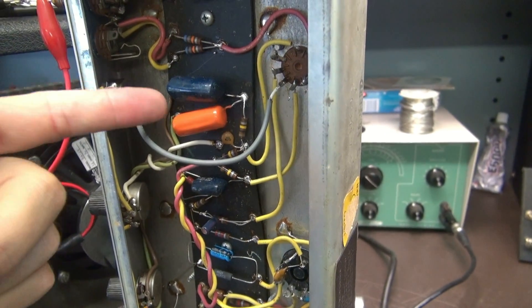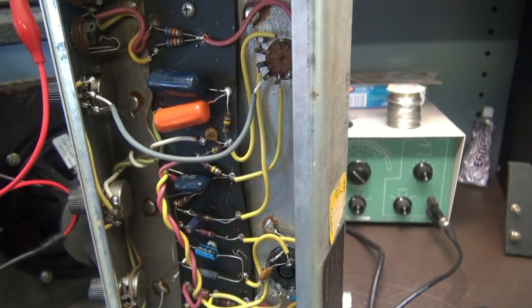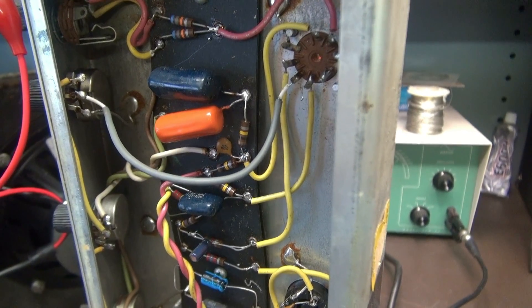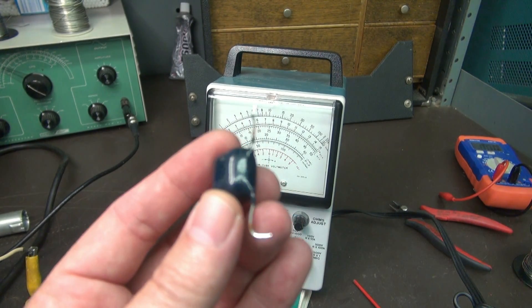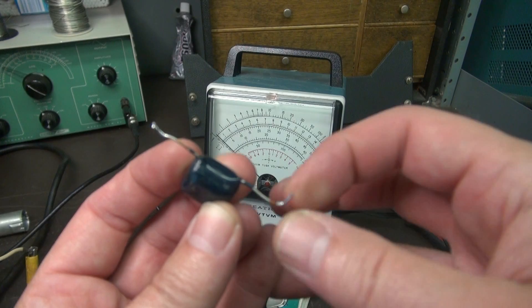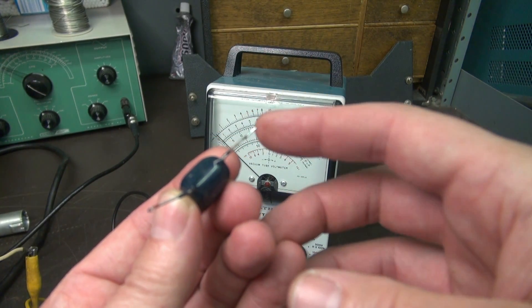Now since I changed this one, we've got these old blue nasties — there's only two of them left. I'm going to go ahead and put Spragues in, and of course return the old ones to the owner. You remember I suspected that lead was loose, busted loose in the cap? Watch this. See this lead? Nice and stable. Look at this one — boing, boing, boing, boing. It's broke loose! Did D-Lab call it or what?